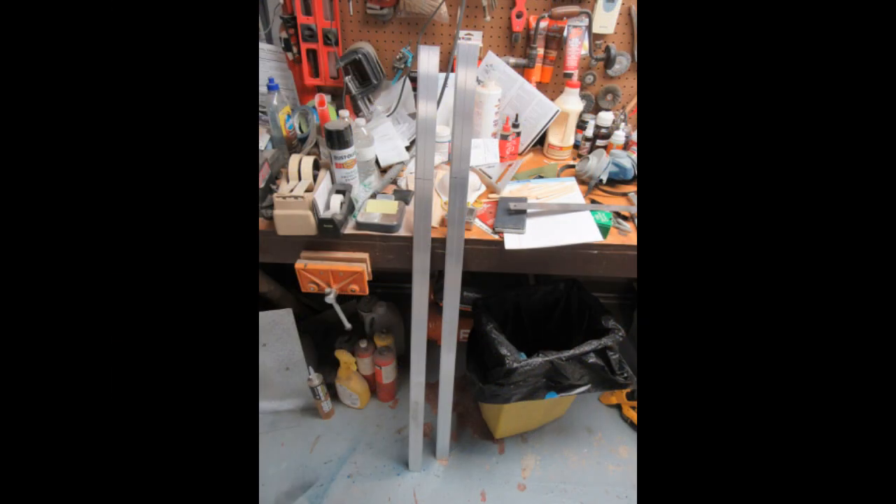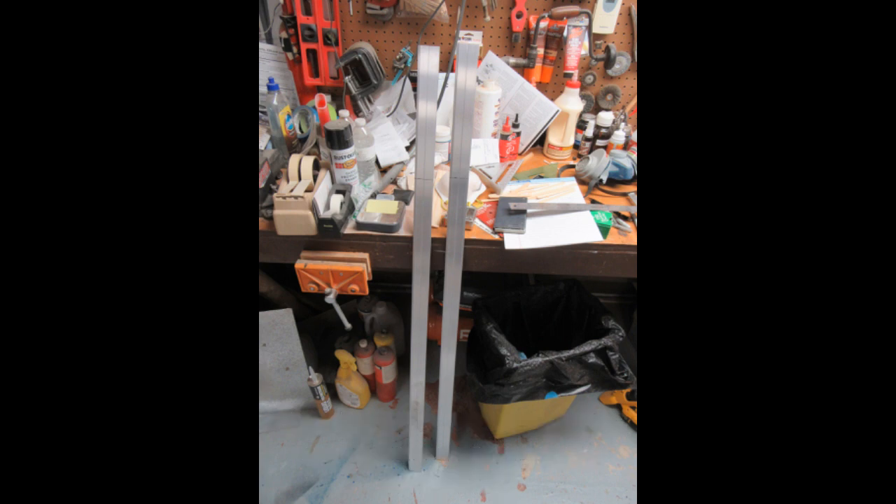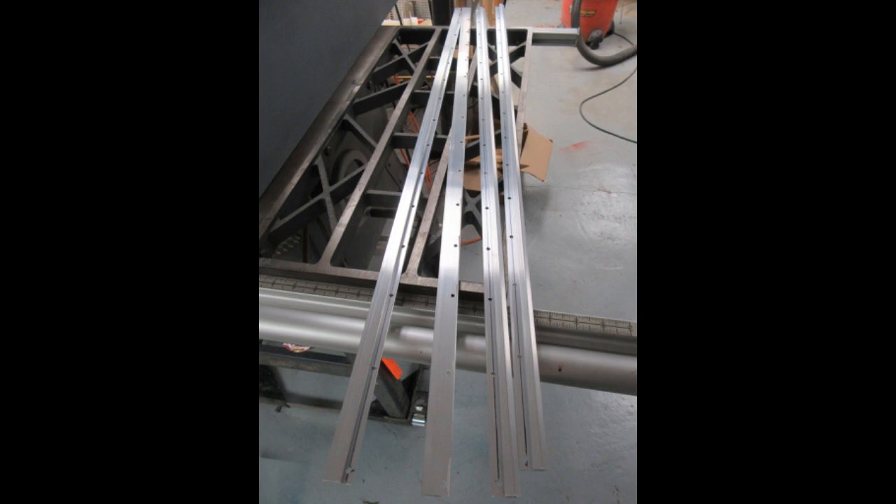I use aluminum valence strips to reinforce the edges further and to assure alignment along the long edges. These are purchased from Reliable Hardware and they're sold in 12-foot lengths, but they commonly cut them into 4-foot lengths at no charge. I used two of those for each of these large cases and cut them down to the desired length. Each extrusion is actually a top and bottom half of the valence. Once cut to length, I clamp them in a vise and break them along their pre-made thin spot — just bend it back and forth a little bit and they break cleanly in half. Then I drill holes in the flanges of the valences so I can screw them to the reinforcing strips on the case.